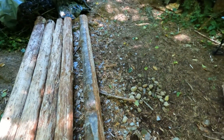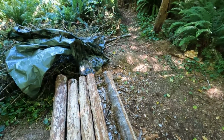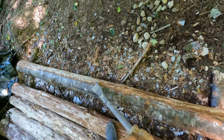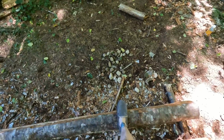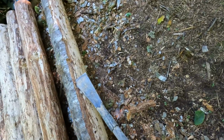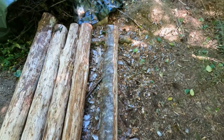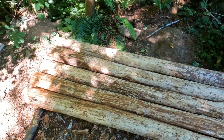So after putting 2 or 2.5 feet into the ground, that's still gonna give us 6 feet or better sticking out. And the walls are 7.5 feet at the edges of the holes. So the walls are gonna be almost 7 feet wide, or a little better than 7 feet after the logs are put on the inside, I think. So anyhow, that'll be a good amount of stuff in the dirt. Plenty left on either end to cut off, because it's all gonna get whittled away on the ends to fit. So that's the idea.